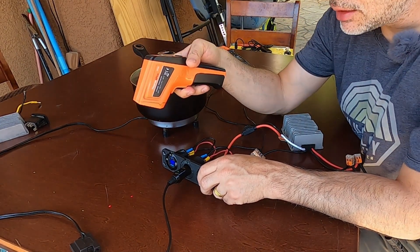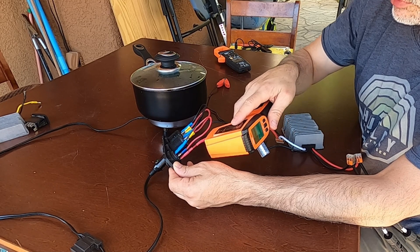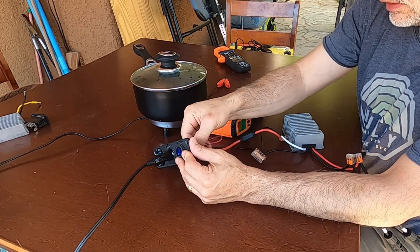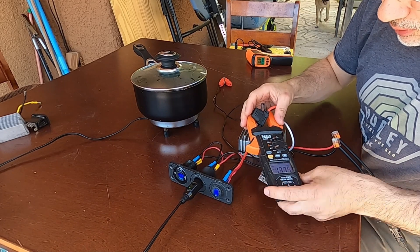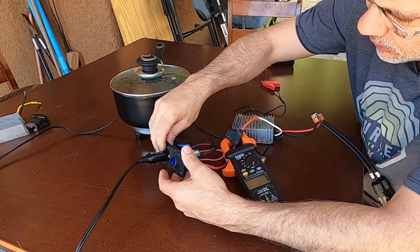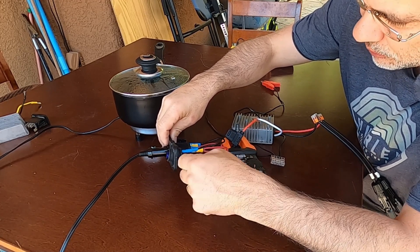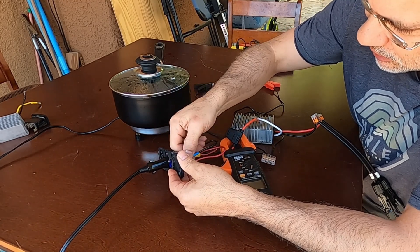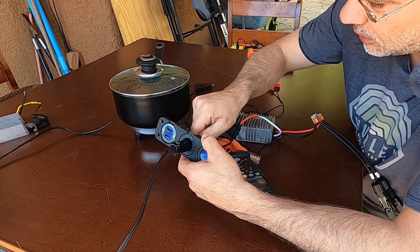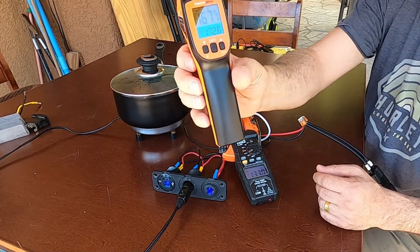Since this connection is so tiny it's pretty impossible to line up both dots on it, so I'm not sure how accurate a reading we'll get. The connectors are warm but the wire is perfectly fine — we're sitting at 13.3 amps right now. The one that's not wrapped in heat shrink you can't touch for more than a couple seconds, but the ones with heat shrink you can hold onto fine. No more than 15 amps on these things, which is all you really need to power any of the USB devices. About 170 degrees.